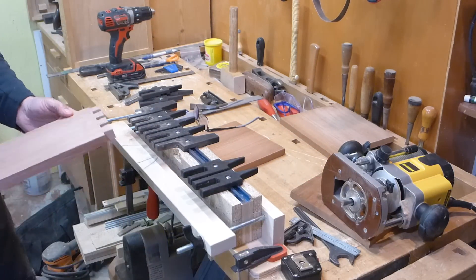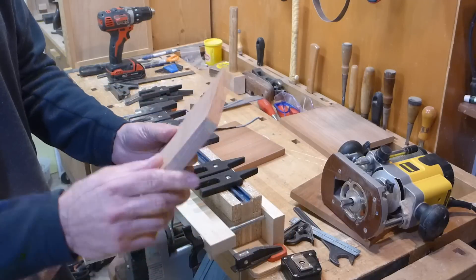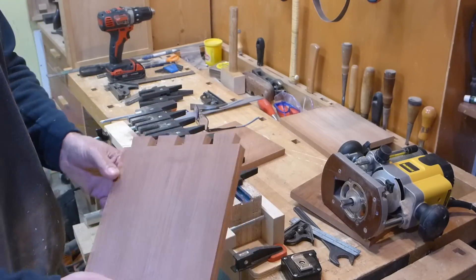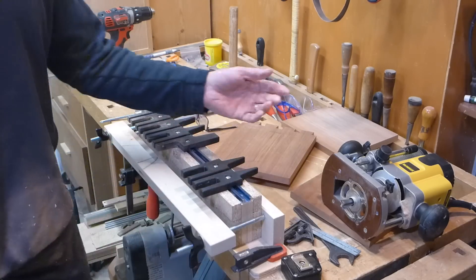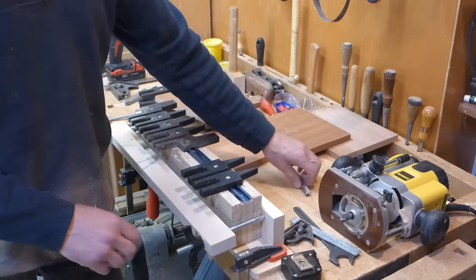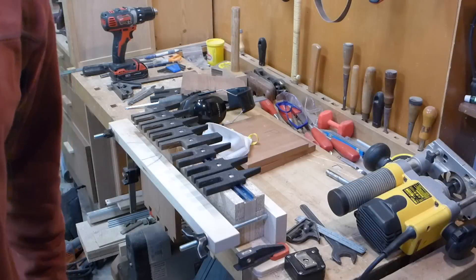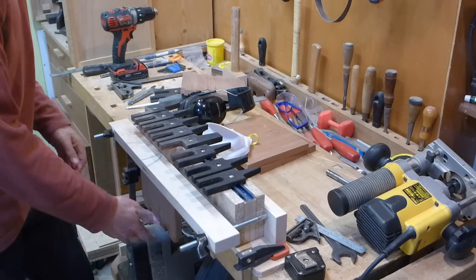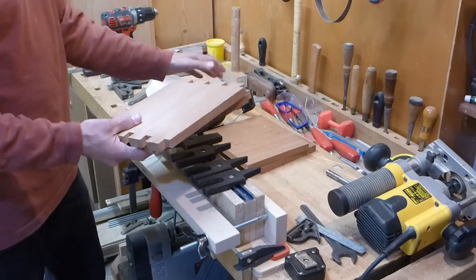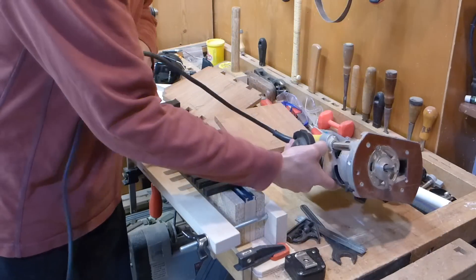Let's see what that looks like. Those are the tails — it's a nice clean cut. This is actually some very old redwood; notice that nice fine grain. I tend to get a lot of tear out with this, so the jig allows me to make a clean cut without a lot of tear out. I'll finish all of the tails, then change the dovetail bit for the straight bit, flip the jig around, and proceed to cut the pins.